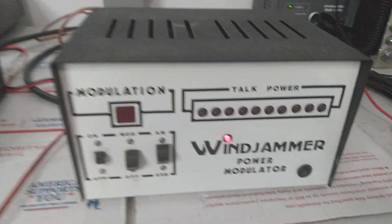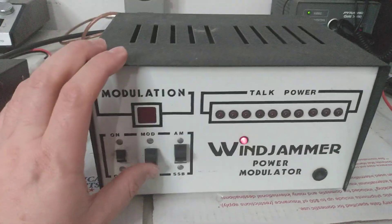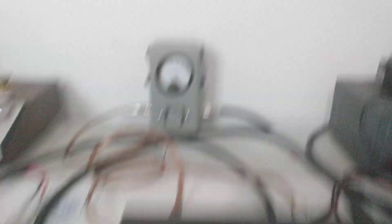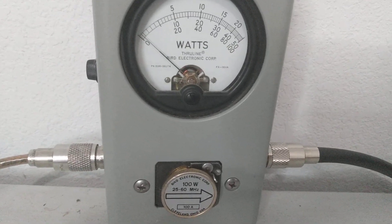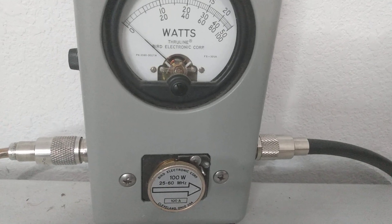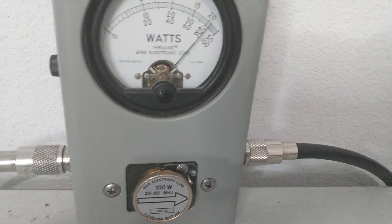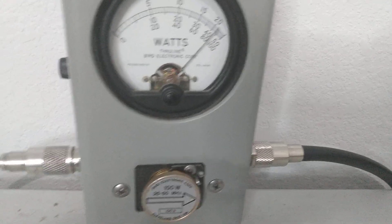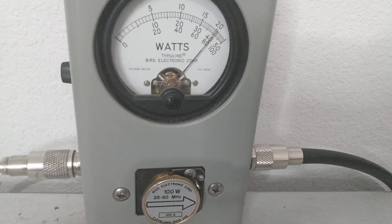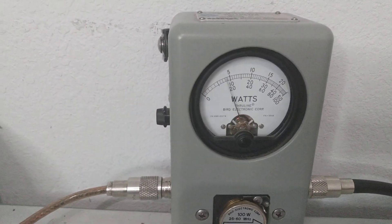Something like a Tram, Browning, or Sonar — something like that is going to work really well with this thing. We'll flip it up into the mod position and flip my meter back on peak. So 1000 watt slug — remember, we're putting 25 in. It's maintaining a really low dead key and swinging looks like about 80 to 90 watts PEP. When I had my 500 watt slug in it showed about 100 watts PEP, but this one's showing between 80 and 90. Depending on the voice peaks, it's doing almost 90 watts PEP. Getting with it pretty good.